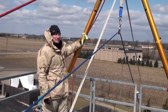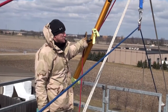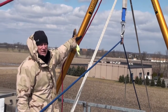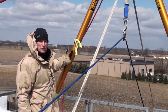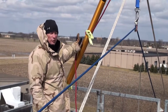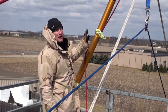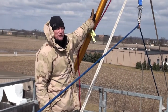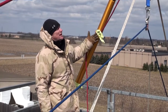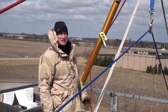The Paratech bipod is very simplistic and very versatile. Here we're using two 610 struts with two 435s, or four-foot extensions. The same rules apply with the golds as they do in vertical shoring applications. Whether you're using 610s, 812s, 235s, 435s, or 635s, you can get some really significant height with this bipod, and it's very quick and easy to manipulate.